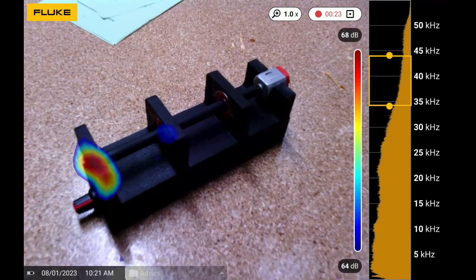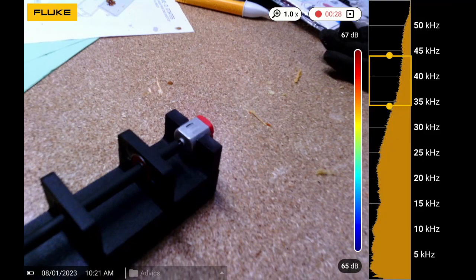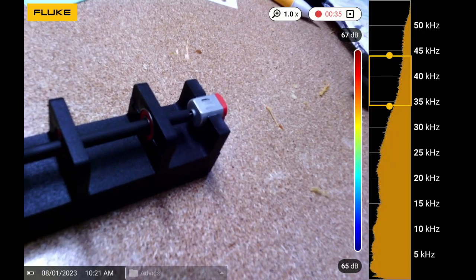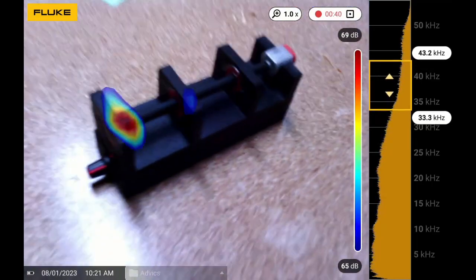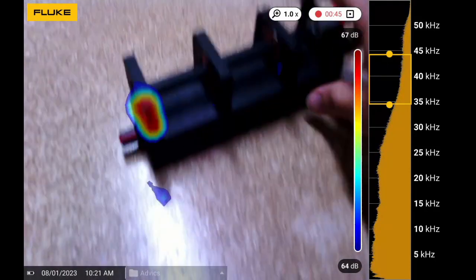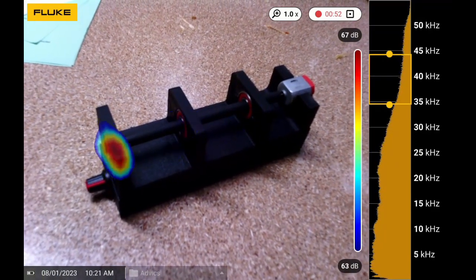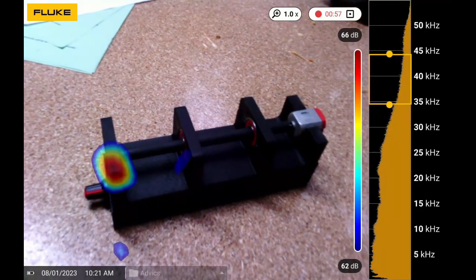You can see the leftmost bearing really has a lot of color on it. The center one, depending on if I can get the leftmost bearing out of it, also has some flickering. You'll notice that it's more of an intermittent thing — it's not steady. You're going to find that with more of these MECQ solutions when you're looking at conveyors and stuff that it won't be this solid color like we have on that left bearing unless the bearing is pretty bad. It'll be more of that intermittent bearing color.